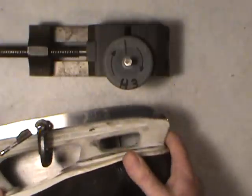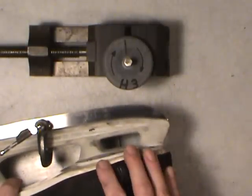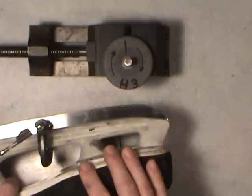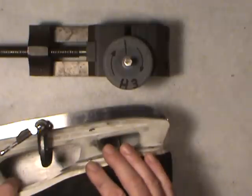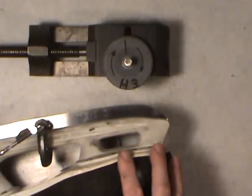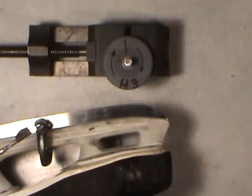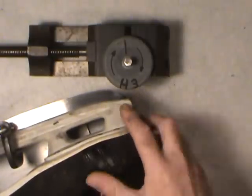But when it comes down to actually grinding, there's the roughing stage where you're just basically trying to clean the blade up, and if the nicks aren't too deep or whatever, you can get them out of there and make sure it's making a full grind on the full hollow of the blade, not just partial. Otherwise you'll have a bunch of sharp bits on your blade and some dull ones too, so I'm always inspecting visually.